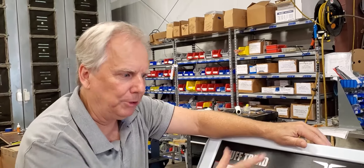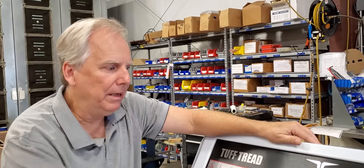And that's a grade recalibration on pretty much any of the TuffTread models. The layout may be different, but just follow that button sequence the same way and do a manual recalibration using the power button. Thanks.